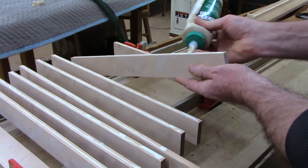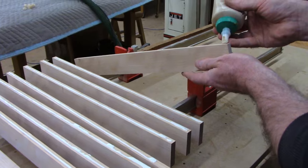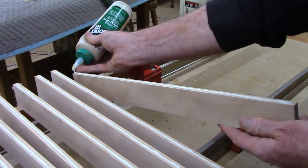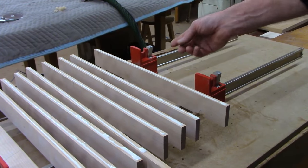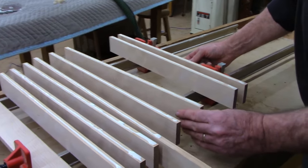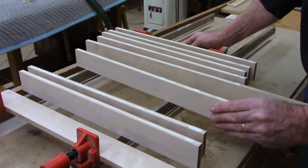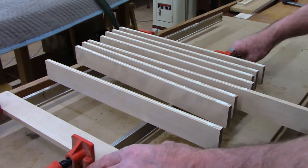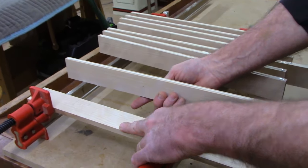They said that they tested Titebond 3, and the way they tested is they put it in a 150-degree oven overnight, and then they test the strength again. Normally, they said it loses 2/3 of its strength overnight at 150 degrees, and its strength is 4,000 pounds shear pressure at full strength. So you have over 1,000 pounds still of shear strength after overnight at 150 degrees. So this is going to be fine for holding a pizza, and not for a few minutes.